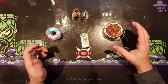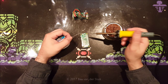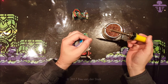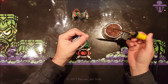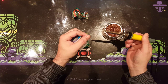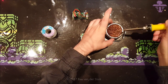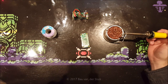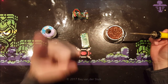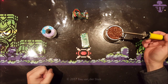Before you start, make sure that your solder iron is hot. It gets very annoying if it is not hot enough. You can just check it by applying a little bit of solder to the iron, and if it is smoking and taking solder, then it is hot enough. I'm going to move my camera so you can actually see close-up what I'm doing.